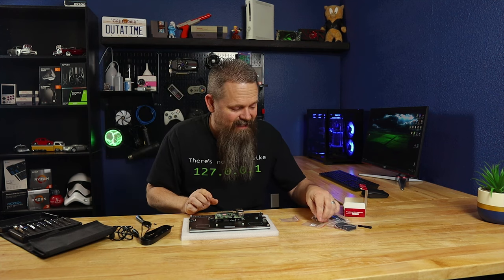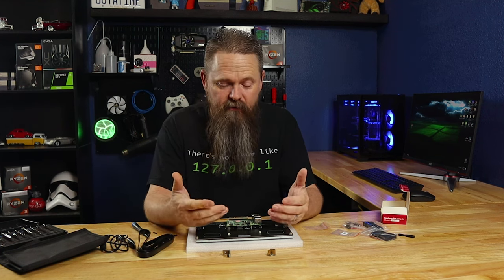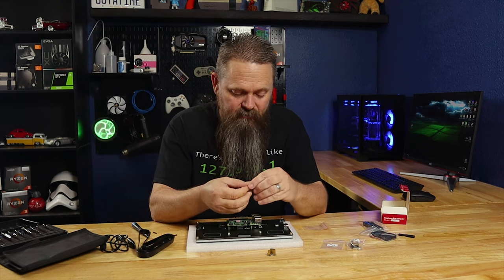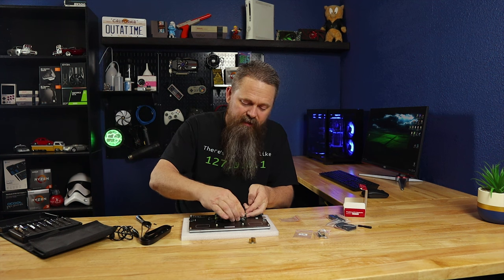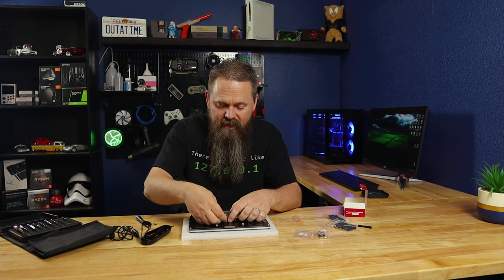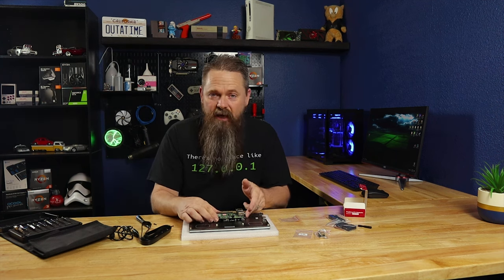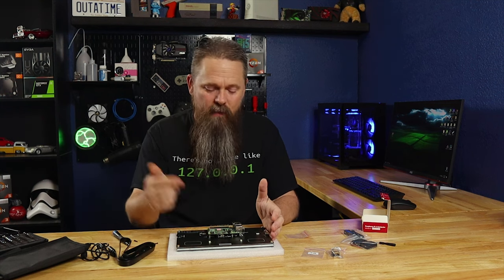Once you get it screwed down, use the little adapters that come with the kit. Which adapter you use depends on which Pi you're using — I'm using a Pi 4 here, so I'm going to use the 4B package, but it also comes with a package for the 3B as well. To install these, plug each adapter into the port that corresponds with the same port on the PCB. Then the HDMI adapter plugs into the bottom HDMI on the PCB as well as the HDMI on the Pi itself. With these adapters, it allows you to get video out from the Raspberry Pi to the monitor, and also power the monitor from the Pi itself — so there's only one power cord going to the unit.